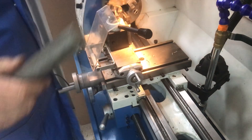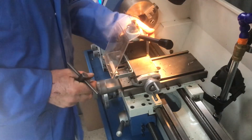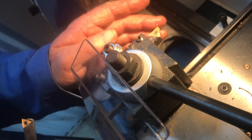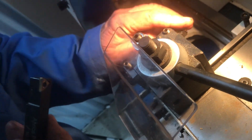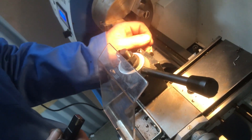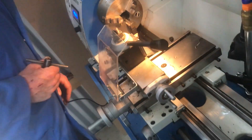When you use aluminium, what can happen is you get what they call tool build-up on the end of the tip. If you get tool build-up on aluminium or brass, instead of cutting it starts to scrape and pull, and eventually the tip will break off. A lot of people blame the insert rather than using the right type of insert or the right fluid. If you're going to use aluminium on a CNC or lathe, put a little bit of tap magic on the end of the tip.